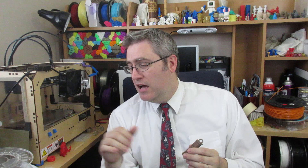So I had to order a hardened nozzle, but it didn't arrive until after the job was done. I ended up pushing about two and a half kilograms — about two full spools — of bronze fill through a normal brass nozzle. It actually held up to it. It wasn't until the end of that whole process that it started showing signs of wear — that being that it's not pushing out enough plastic, things come out a little sparse, and you get holes in your print. When you start seeing those holes you know the nozzle has been widened. Strangely, my normal brass nozzle survived a lot longer than I expected.